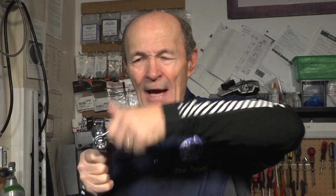Now, if you're a scuba diver, you've been around any length of time, you know what a reserve is. A reserve is simply a device, usually on the valve, not always, occasionally it's on the regulator, but usually it's on the valve. And the reserve is, as its name implies, simply a device that saves a bit of air. It reserves a bit of air, so that when you run out of air, you're not really out of air. Then you can reach back, not with your hand, there's a rod or a cord, and this lever slips down, and that little bit of extra that's been saved, that little bit of reserve, comes out. Typically, the reserve is set for about 300 PSI, sometimes 500 PSI, which is good for 4 or 5 minutes, which is not very much.